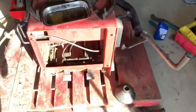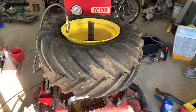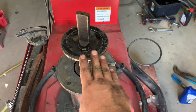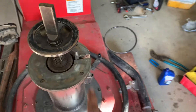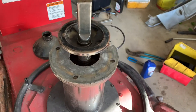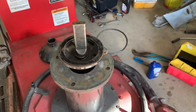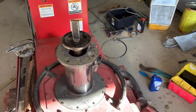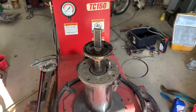So there's our tire machine — pretty cheap, easy fix. Thanks for watching. I was having a hard time getting this to actually hold the wheel down. This is the thing that I said goes into the lug stud, so there's that. You screw that down and then you pull on this thing and it pulls the wheel down and holds it tight against there. Then you hit that and it lets it go. I just figured I'd add that to the video. Anyway guys, thanks for watching.